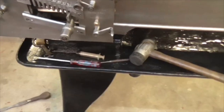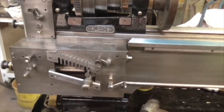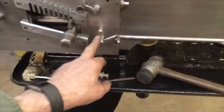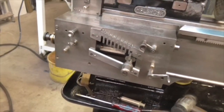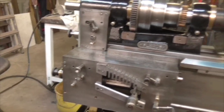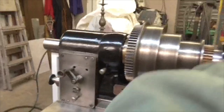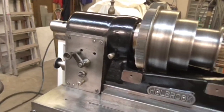Two o'clock. The screw cutting box is on just to test and for show - I need to connect a block inside there so I'll need it off again. I've put the front on permanently but there's a gear that seems to drag inside, making an unpleasant noise. If I move it to a different position, it stops. So I need to look at that.